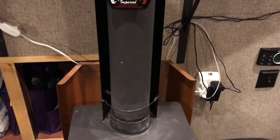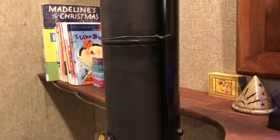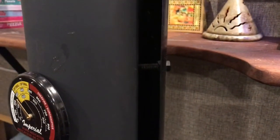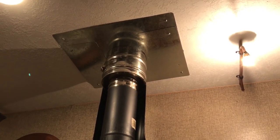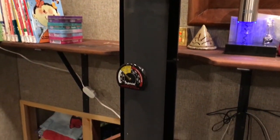For the heat shielding on the flue pipe itself, it's a 4-inch single-wall pipe going up. I took a 6-inch piece of single-wall pipe, ripped it with an angle grinder, and put some bolts in as standoffs from the flue pipe. You can see it going all the way up, and then it transitions into the double-wall pipe exiting through the roof. I used an infrared heat gun throughout to make sure there were no hot spots.